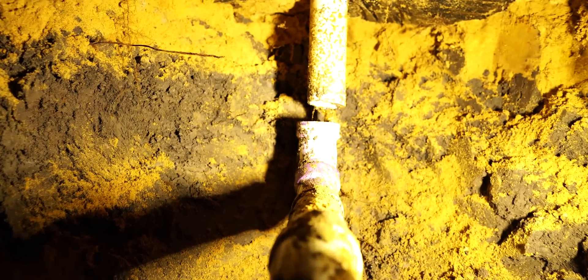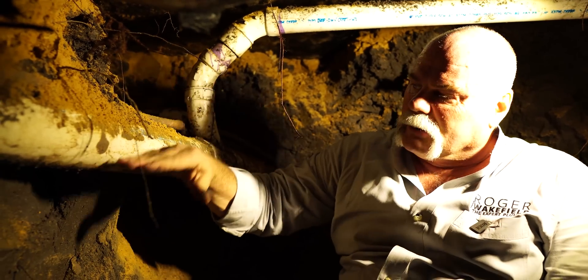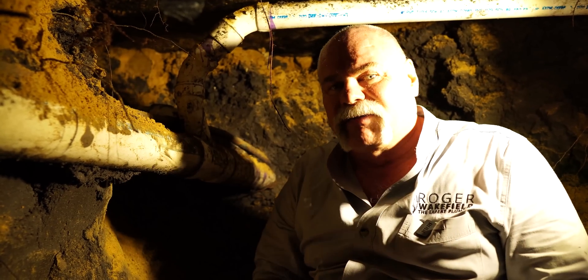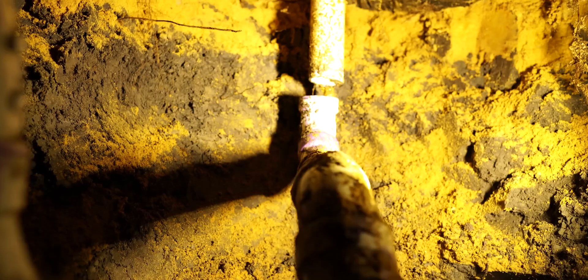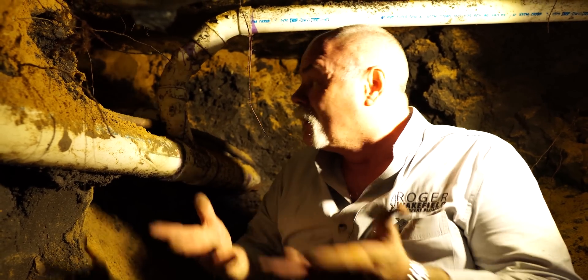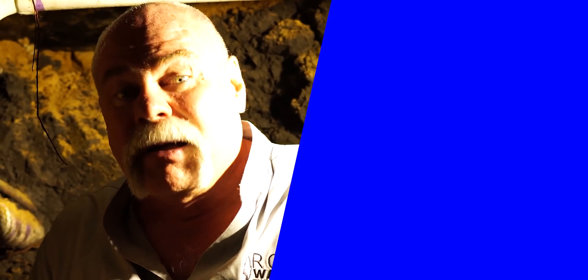Back over there we have another stress break. It doesn't take a lot to do this right — what it takes is a continuous bed along the bottom of your pipe, coming up around it. There's plenty of sand here; you would think it could have been done right. Somehow something happened — a pressure or weight from the earth, backfilling, maybe from the concrete since we're under a beam here. Something moved it around, and on that separation it pulled apart about an inch and a half. That's a lot of stress on a fitting or joint over that many years. Locating slab leaks is sometimes hard, but once we find them we've got to go — we're probably 20 feet up under here.